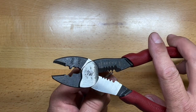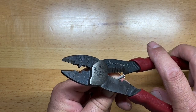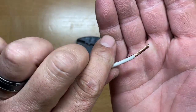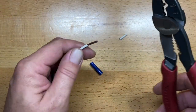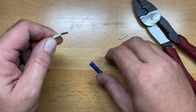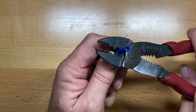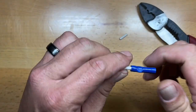I've been messing around with these. This is 12-gauge stranded THHN — not the type of wire you'd use on trailers, but I was really impressed at how clean a job it does for both stripping and crimping. I cut that back just a little bit, and we're going to try out that insulated crimper. We'll set that connector on there and put it for the insulated side.